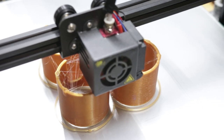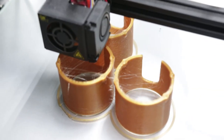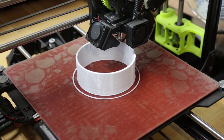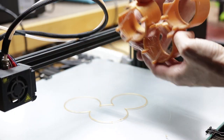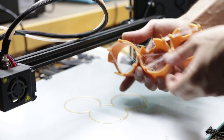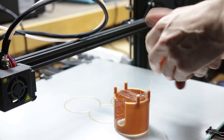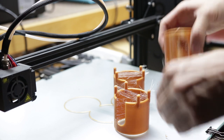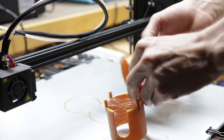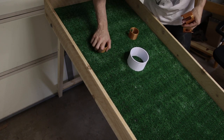Here I am printing out some of the smaller cups using Matterhackers Gold Pro PLA on the CR-10, and over on the LulzBot TAZ 6 I was printing out one of the larger cups using BCN PETG filament. These ones came out pretty stringy, mainly because I printed using a 1mm nozzle instead of the standard 0.4mm nozzle, but that's easy enough to clean up with a wire brush or an X-Acto knife. Once I'd done that, I went ahead and stuck these onto my playing field for a quick test run.